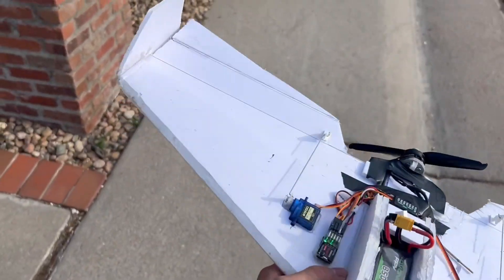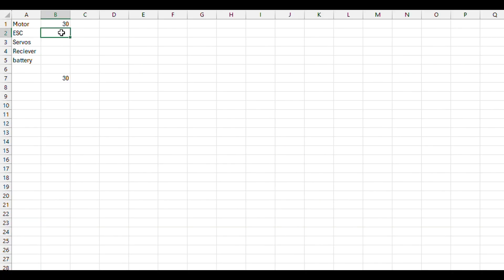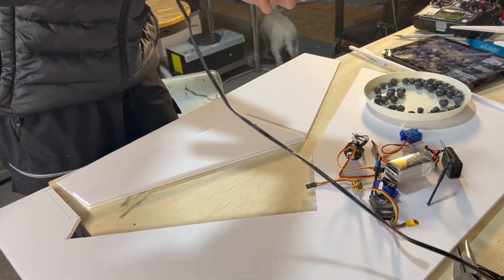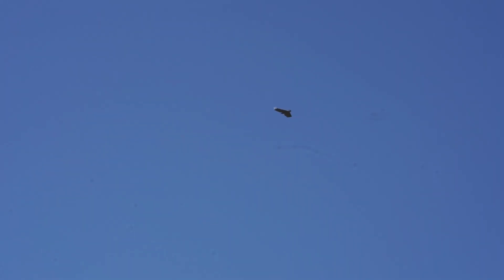I did some more flights with the gyro and it worked great, so overall I'd say this project was a pretty good success — super fun flying this wing around and watching the footage afterwards. The one downside is that with the camera on board the whole wing weighs about 320 grams, much heavier than I wanted. The electronics alone come to a staggering 170 grams, which only leaves about 80 grams for the wing itself. What I'll most likely do is keep this design shape and make an autonomous version without worrying too much about staying under 250 grams — it's smarter to focus on the new electronics first. Stay tuned for more upcoming wing projects!